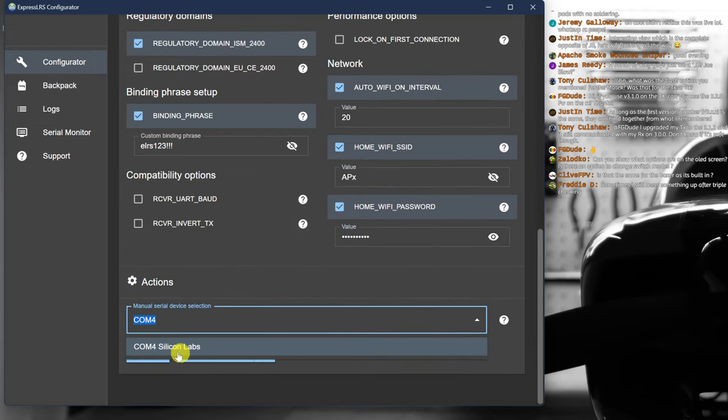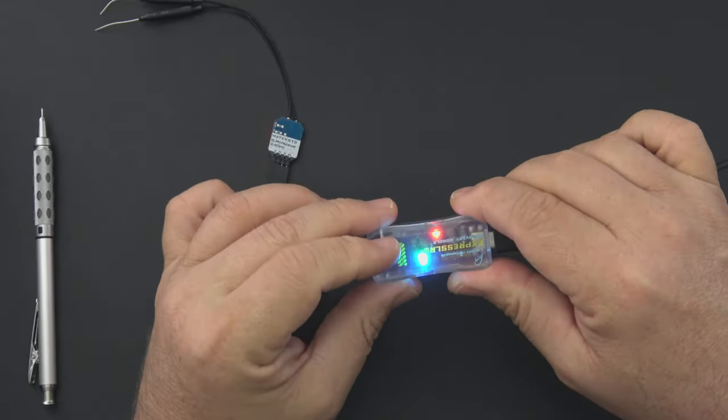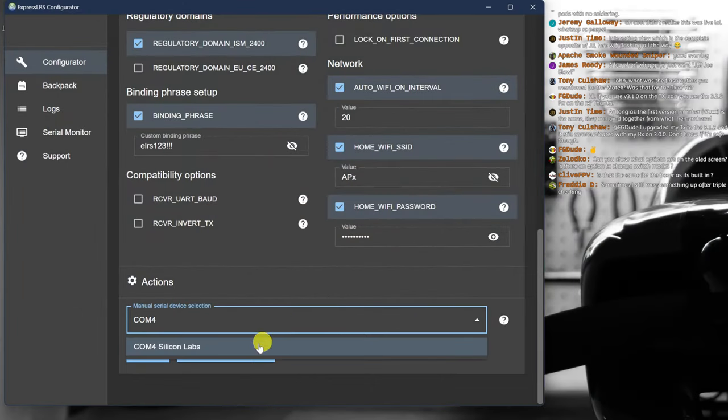And notice that the Configurator automatically picked up COM4 Silicon Labs. Now, if your Configurator is not picking that up when you plug this dongle in, you probably have a driver problem that you have to sort out, okay? Again, I'll put the link for Silicon Labs in the description after the video's over. Sorry for not doing it ahead of time. But you've got to make sure the driver's installed. And if it is installed, then the Configurator, without fail, will pick it up. Every single time, it's always picked it up for me once it's plugged in, okay? So you have to see some COM port available that the Configurator sees. Yours might be COM5 or 6 or 7, but your computer or Configurator should see it, okay? If it doesn't, don't even try and flash. You have to sort that out first, okay?